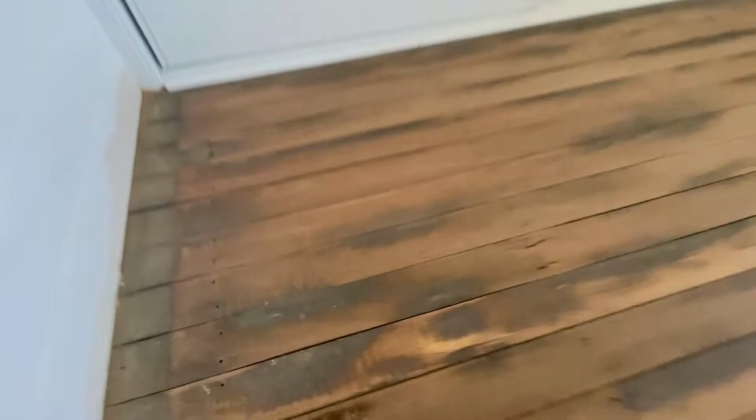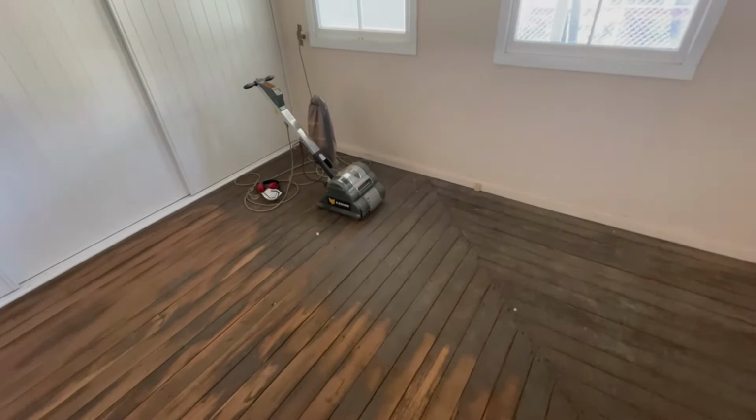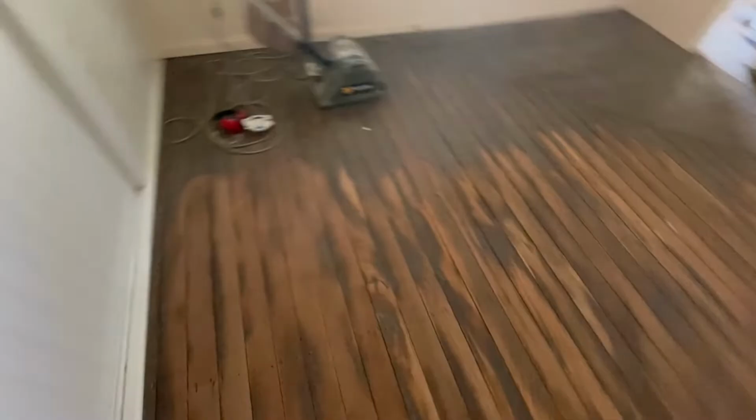Anyway, I've got the rest of the afternoon hopefully to just fine tune this floor using the 40 grit, which is decently gritty. I don't think this floor needs much more. I could be wrong. I've used 24 before, but that can be seriously traumatic and gritty. Anyway, back to it.